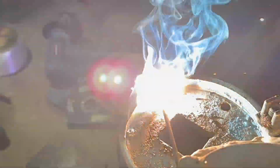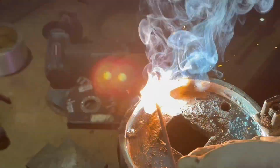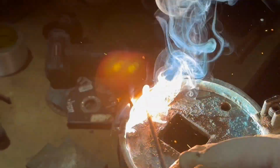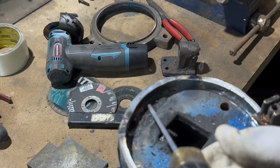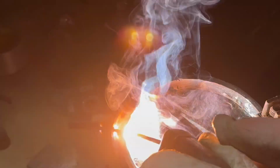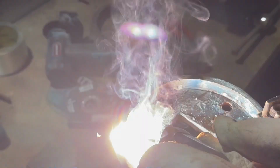It's just a bit difficult to get the welding rod running. You've just got to hold it more or less a millimetre over what you're doing, or that will happen. It takes a bit of practice if it's your first time. I would suggest practicing on some scrap first.